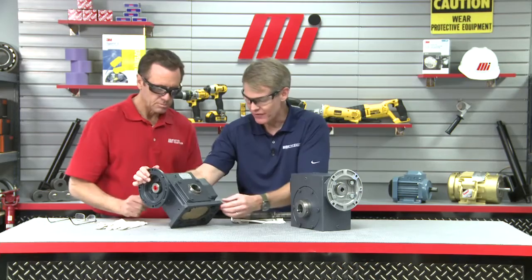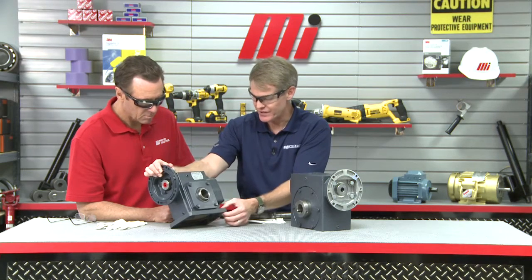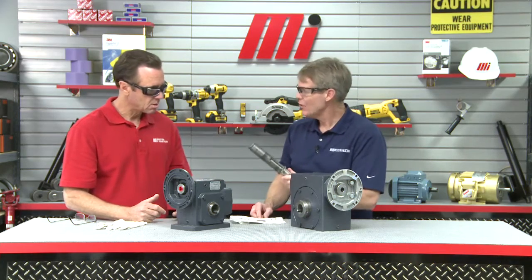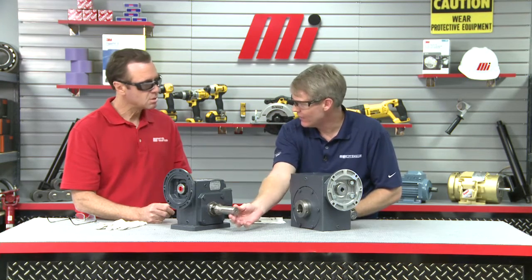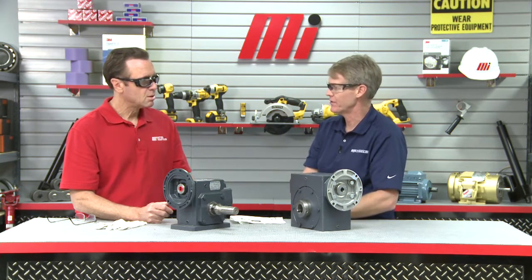Let me show you. First off, it's a B-base kit, held on simply by four bolts — the maintenance man can put this on. This gives us the correct height of the output shaft and raises the gearbox up. Secondly, it allows us to not have to change your bolt hole patterns because it will drop directly into the worm speed reducer footprint. You can find different size plates depending upon how high or low you need to go. For the output shaft, we offer a universal shaft kit held in by a retaining ring — you simply slide it in. It gives you the correct outside diameter and the correct centerline length to the output shaft end, fitting in the same envelope as your worm speed reducer. It's really that easy to replace an inefficient worm speed reducer with a HERA.